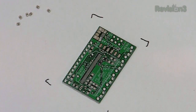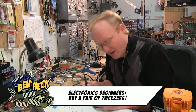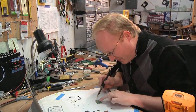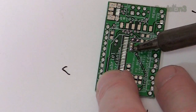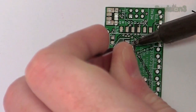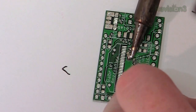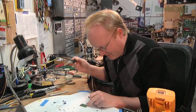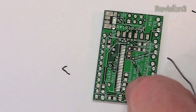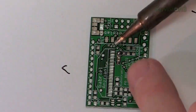I've pre-tinned these pads and, going off the reference sheet, I'm going to attach the capacitor using tweezers — which are the most important tool I have, seriously. We put it in place and melt the solder around it. Once it's in place, you heat up the side with a little more solder and watch how it kind of aligns itself, similar to what it would do in an oven. You can remove excess solder by pulling it away quickly with the iron.